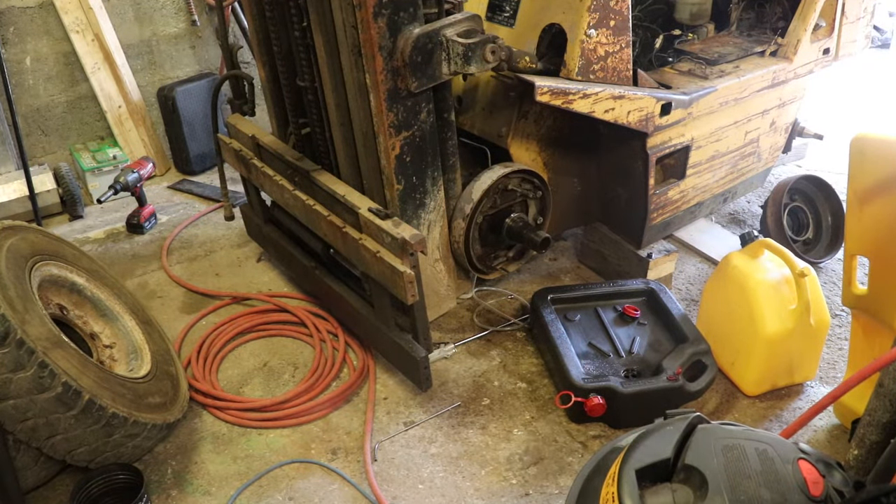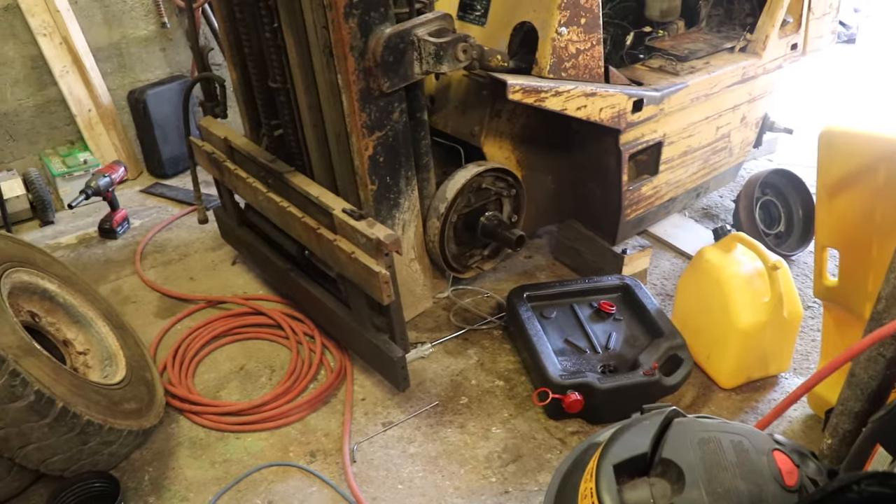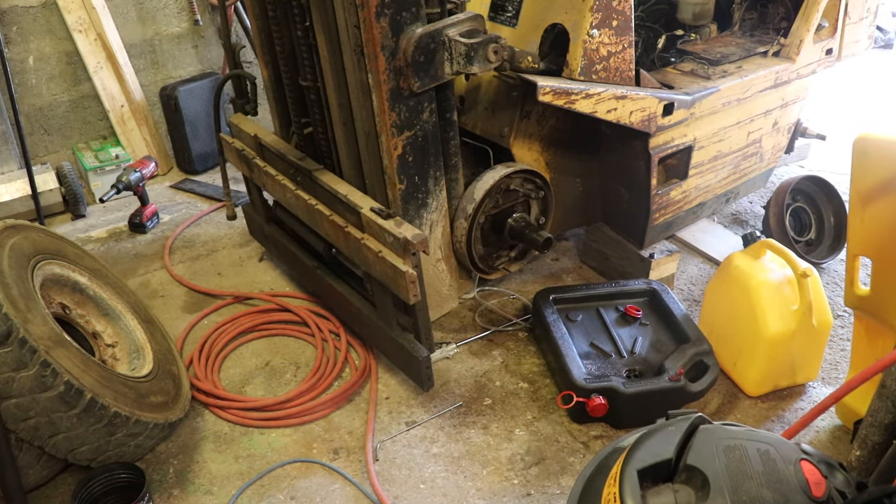The camera seemed to shut down while I was working. I've got the diff as clean as I'm going to be able to get it, so now I'm going to focus on fixing the parking brake on the far side. The wheel cylinders are working and not leaking. The main problem is that the wheel seals leak, and it turns out the wheel bearings are compartmentalized from the differential so they shouldn't be seeing the oil in the diff. I'll get a parts order going. I think this is going to be the end of the first part of working on the wheel bearings — I'll get this part of the video out and piece together another video when I put it back together. Thank you for watching.